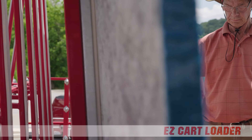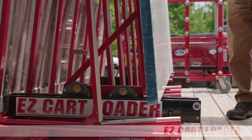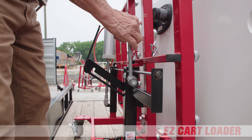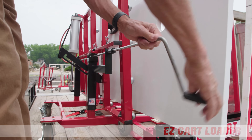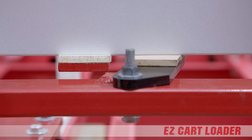Here, we demonstrate how a full-size slab weighing 1,200 pounds is moved effortlessly with one finger from the transfer rack onto the EasyInstallation Cart. Thanks to an easy-to-operate hand crank, two synchronized 7,000-pound mechanical jacks will assume the weight of the slab to raise it off from the EasyLoader and onto the EasyInstallation Cart.